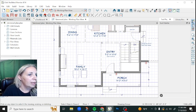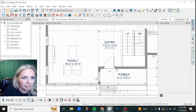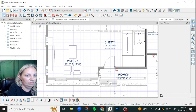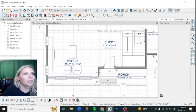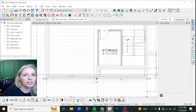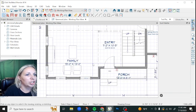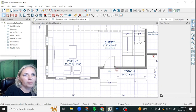I'm leaving just this one post right here until we can confirm with an engineer that it's not needed. We're going to grab the front wall of the house, the front railing, these posts, and the set of stairs and move them back two feet. We've moved our front wall back. Now this auto foundation thing popped up because the foundation hasn't moved back, so we're going to move this over. Now that does mean that this front porch is only three feet deep, so it's really more just for the looks and aesthetics on the outside.